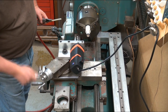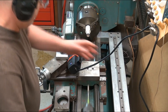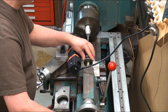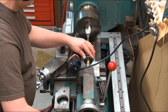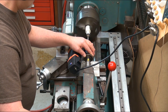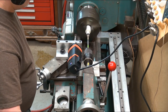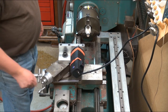I'll get the router out of the way so I can ream the hole. Clean out the chips and feed in the reamer. Now I know that bore is perfect — the 3/8ths pin will fit in there with a pop.